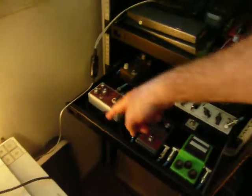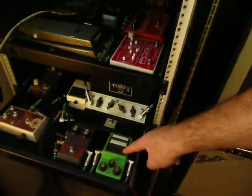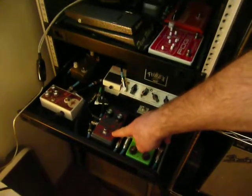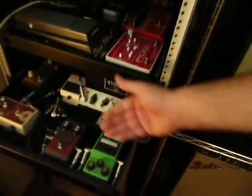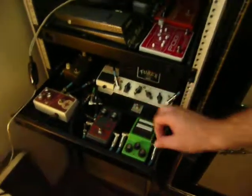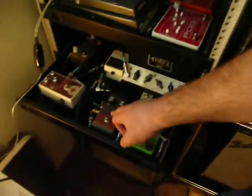All the DC is run along the outside — this is the only AC pedal in this tray. This is an old 80s TS9, you probably recognize that. That's the DoD compressor, which gets a lot of bad press because of its breathing. You can actually fix a lot of that — I changed the op amp in it and really cleaned up the signal, because before it was just very noisy and added a lot of noise to the signal. Not so much anymore.